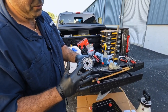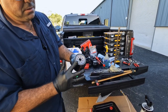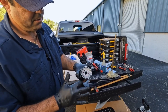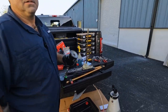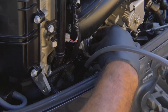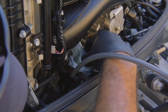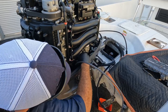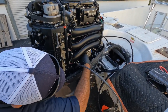You're supposed to use oil too, but I like to use this extra protectant — it'll stay for a while. Never get any grease on the inside obviously. Make sure to clean off the surface. See this salt build-up right here? We'll clean off this little trough and get all that salt out so that the new filter we put in there has a good chance of not corroding.